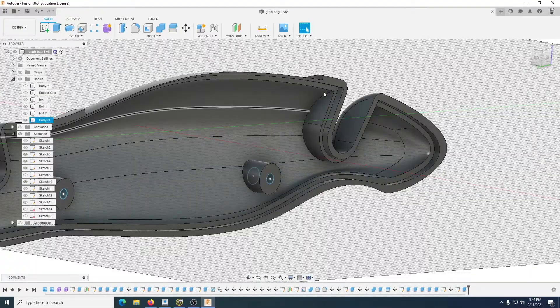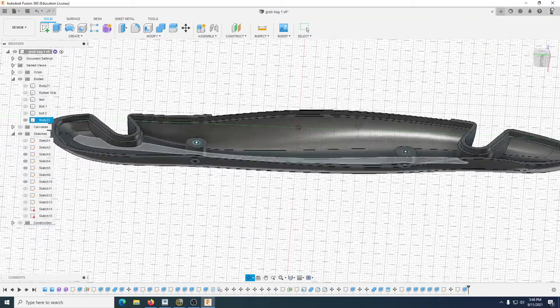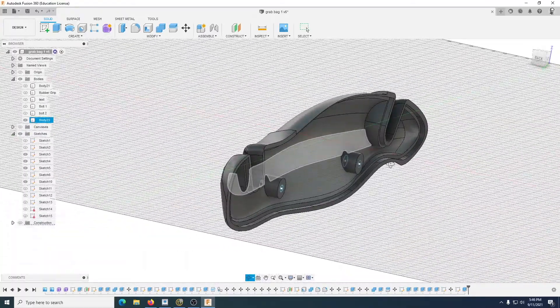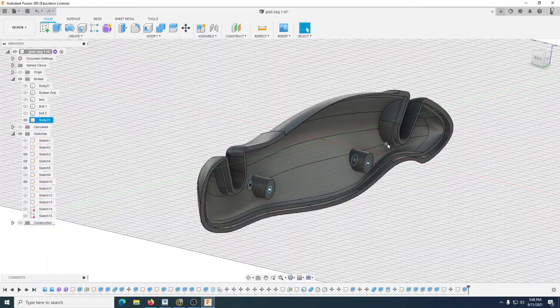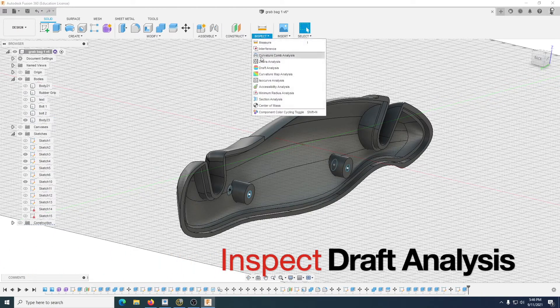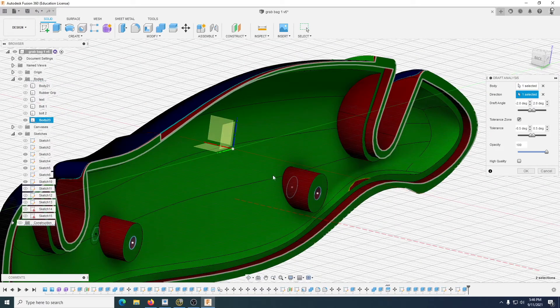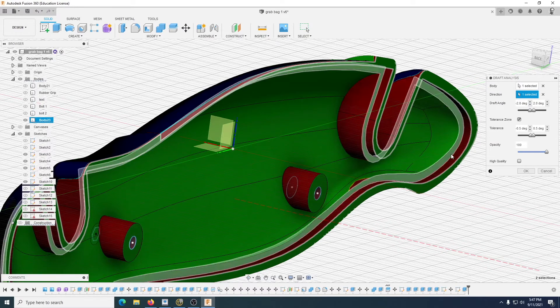On this side, we've got to make it look like it could be injection molded or die cast. In order to do that we need something called a draft angle. Basically, if there are any vertical faces like this, it won't come out of the mold. So we go to Inspect > Draft Analysis. We look at this body here, and set the direction. You can see this would come out of the mold easily, but this wouldn't, and nor would this. That's not a massive problem because it's only like 2mm — with force it would pop off — but these would definitely cause a problem.